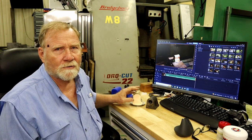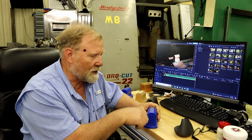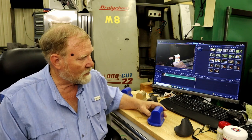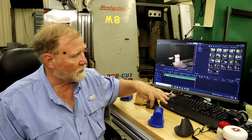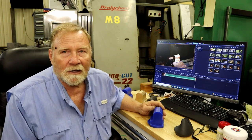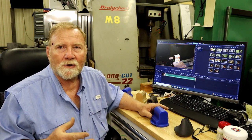Well, one of the things that you're going to say is why I milled it in different steps with different step overs. I could not for the life of me get this machine to run and just circle and just keep going like this. It would go back and forth in the programming. The only way I could get it any closer was to tell it, and this is weird, that it was a 5-inch piece of stock.